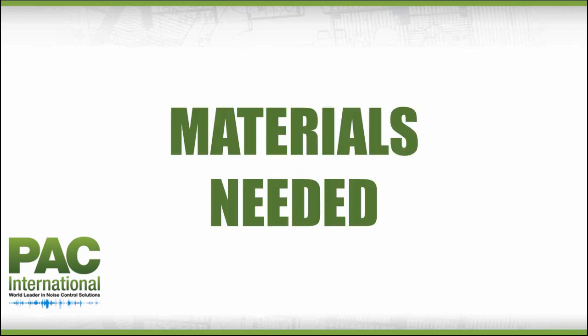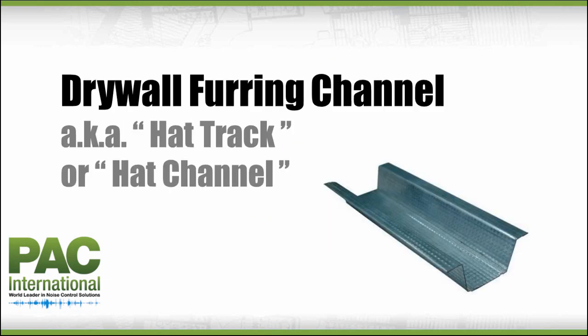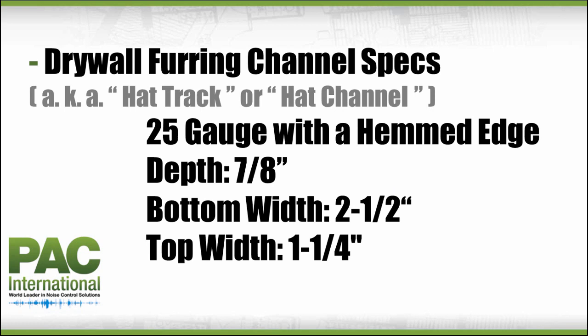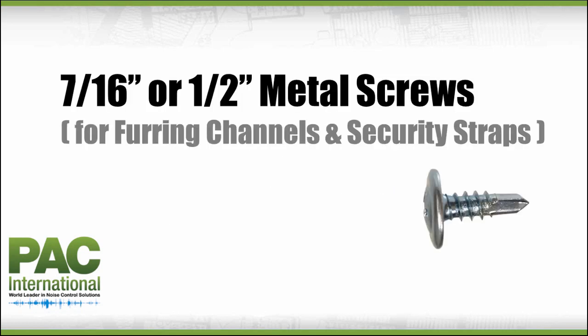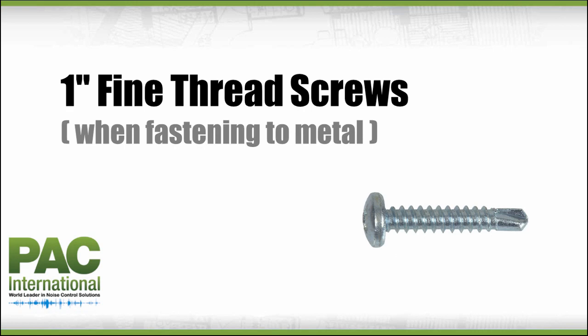Materials needed: resilient sound isolation clips, drywall furring channel, also known as hat track or hat channel. Here are the drywall furring channel specifications. 7/16 or 1/2 inch metal self-drilling screws. These are used for securing overlapping drywall furring channels and fastening security straps. Approved coarse thread screws when fastening RSIC clips to wood. Approved fine thread self-drilling screws when fastening RSIC clips to metal.